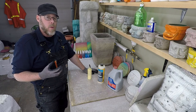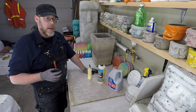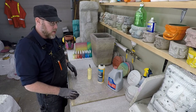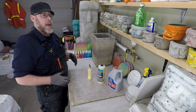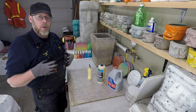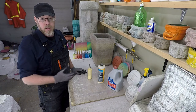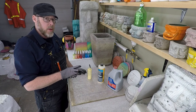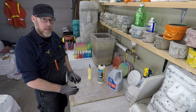If water is readily able to leach into the surface of the concrete, this could result in things like stains or other deficiencies. By adding a glue product to the concrete mix, we help the concrete integrally resist moisture. There are other ways to do that as well — like surface sealers is a common way — but adding glue to the mix is one way to change the characteristics of the product in that regard.